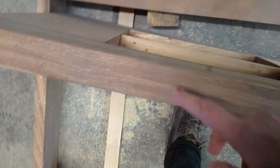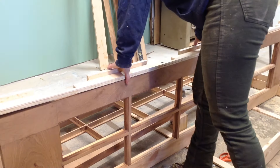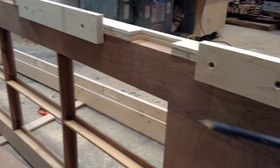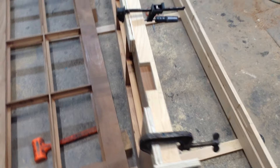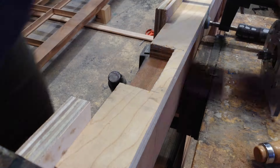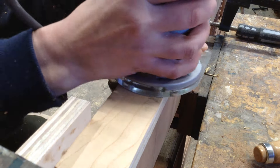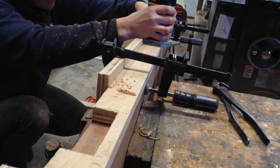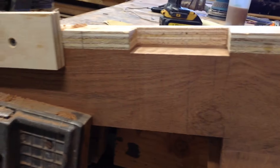It's just another scrap piece of plywood that I attached to the edge, and that will hook on the edge of the door so I know it's lined up perfectly. Those were the marks I put on the door — something I would do in my shop is route these on the wrong side, so I was just using those pencil marks as a reference guide. You can see that now this snaps onto the edge of the door, so I know it will be perfectly aligned with the jamb. The fence sits on the top side of the door; I clamp it in place and make sure that ply is in line with the door.